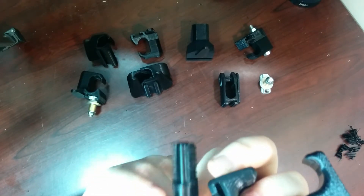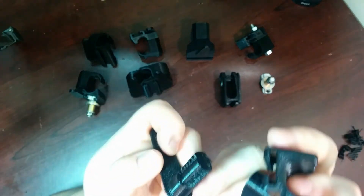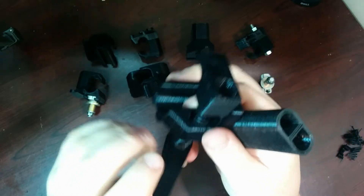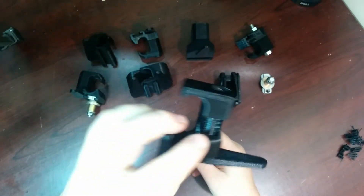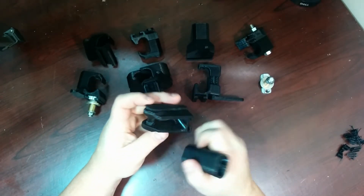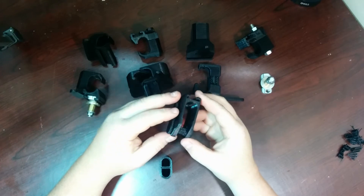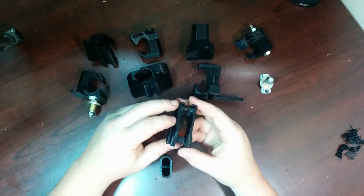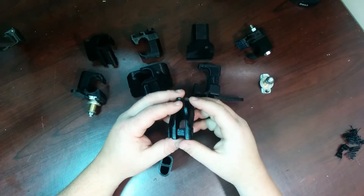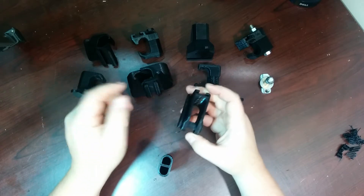For everybody printing threads vertically: it's not if it's going to crack, it's when it's going to crack. It happened to every one of mine, no matter what density or strength I gave it. Printing vertically, you get a lot less strength out of it. So that was the last one I designed with that approach, and then I actually went back to the drawing board. One of my most original designs was to have a thread in the back, and I learned from every one of these which way to print everything and what gave the best strength.